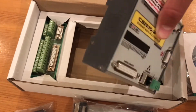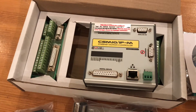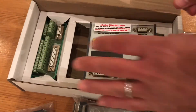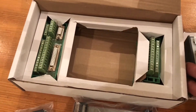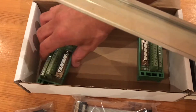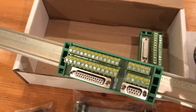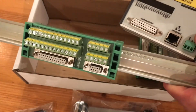On the back it's DIN rail mountable. If you've watched any of my other videos where I've been laying out the control cabinet, you'll see I had a piece of wood representing this as I was laying it out. A piece of DIN rail like this — it will actually mount onto the back, and these connector blocks are also DIN rail mountable, so they mount above and below.